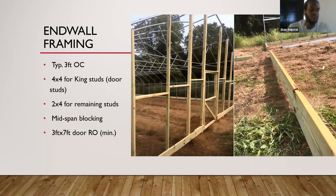when we build doors, you're building a rectangle, right? Effectively. And the rectangle is always going to want to, like everything on Earth, tend towards gravity where the hinges are not connected. So the hinges are only on one side. The opposite side that it's not hinged, that side is going to want to drop towards gravity, usually. To prevent that, you have to install a brace at all four corners.